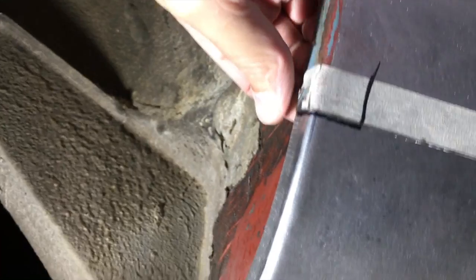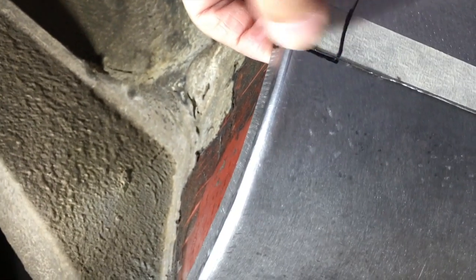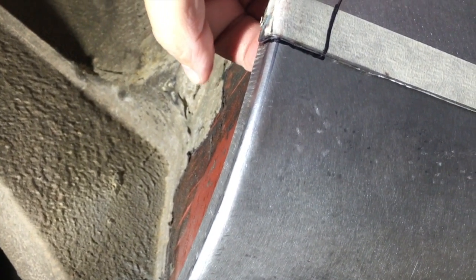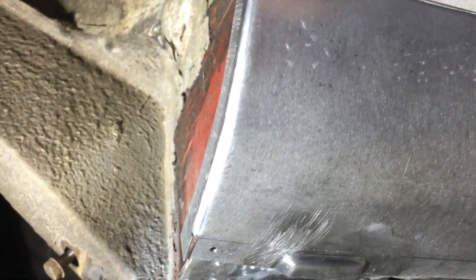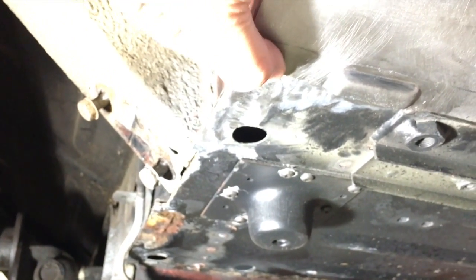And if I have to do fill welding, I can get backer and stuff here, and then this of course already has virtual backer because the closing panel is right behind there, although eventually that'll be filled up with glue. So I'm going to go ahead and take another cut at this and see if we're a little bit closer. If this all lines up and it's still straight, then I'll shoot some new holes across the bottom, here and here,